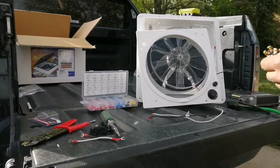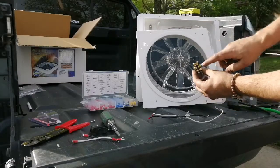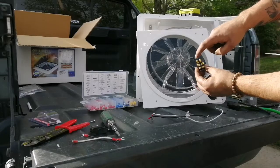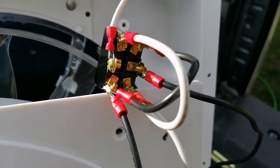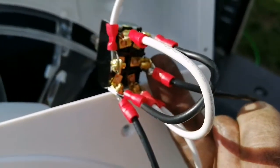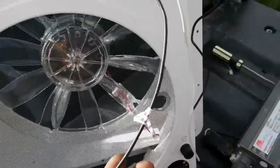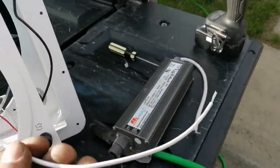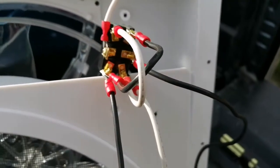To wire this up, we're going to take the two middle leads and connect them to the first two that actually go to the fan. These other four leads — top and bottom — we're just going to make an X across, going from white to white and black to black. Here we have the switch all wired up. The center leads go to the fan itself. Black is on the left bottom and top right, and the white lead comes in bottom right connecting to the top left.